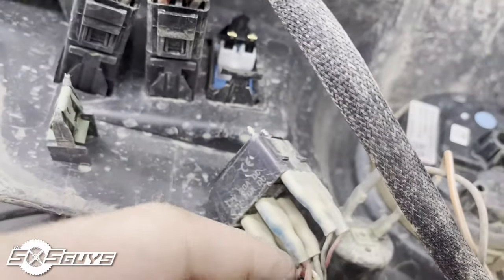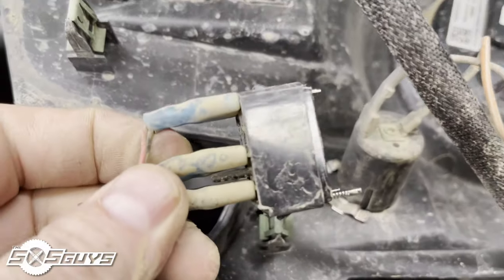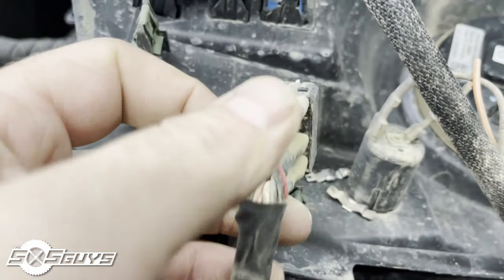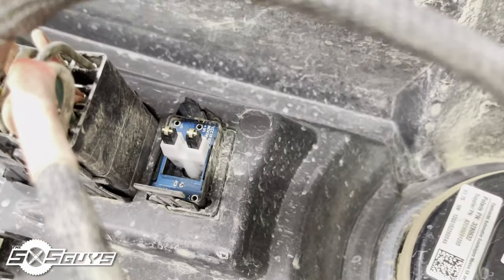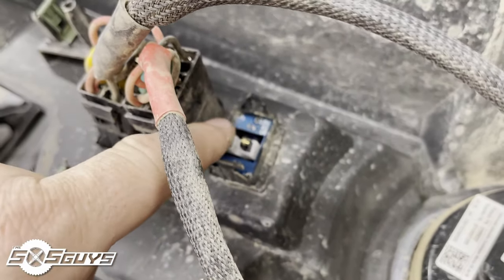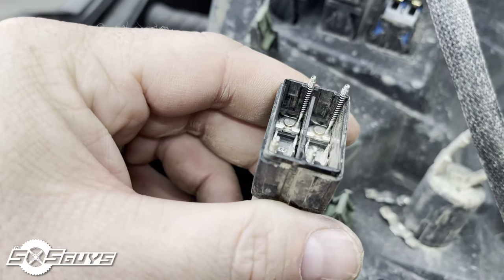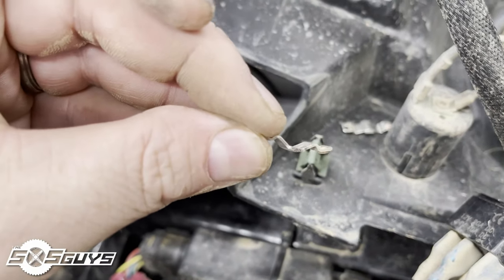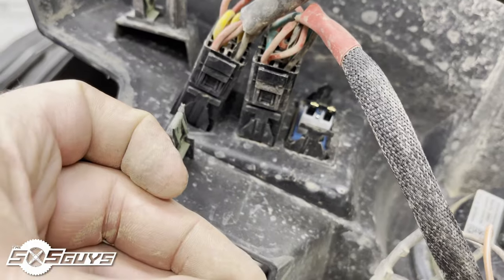I heard jingles and those bad boys fell out. This is what happens when you buy Chinese parts as accessories for your light bars — they tend to disintegrate. The switch post is there; when you're toggling the switch on and off, it rocks in the contacts. The poles make contact and the contacts that flew out act like springs giving you your click and clack. But if they're low-grade, they explode when you take the dash off.